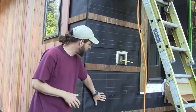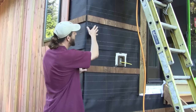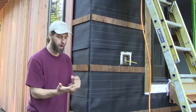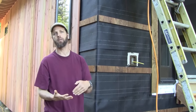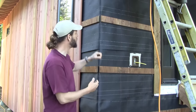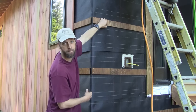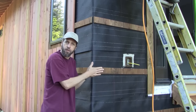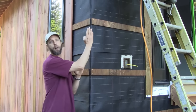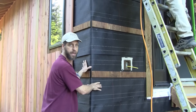While you have this drainage plane, when you're building, think about sealing it up and how water works. Most people think about water as just going downwards, but water will go down and it also has capillary action — it'll stick to itself. For example, a water droplet will go horizontally, and if it's squeezed between two things with water backed up behind it, it'll actually push up. So always think about water when creating your drainage plane.